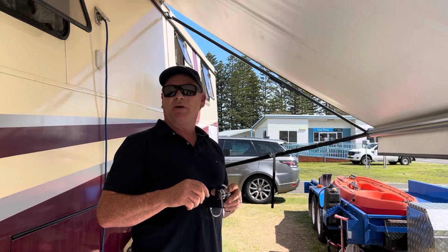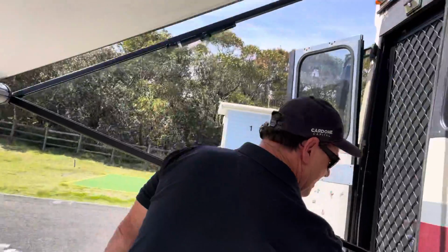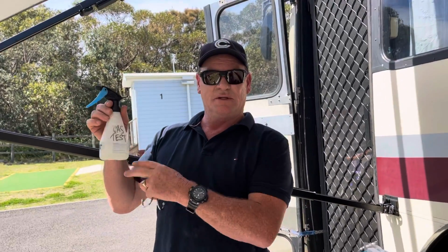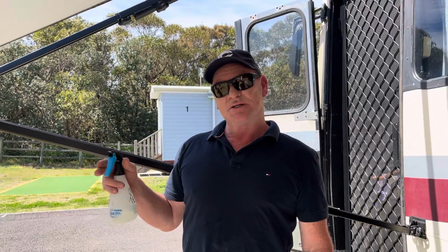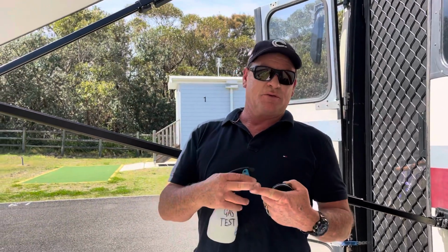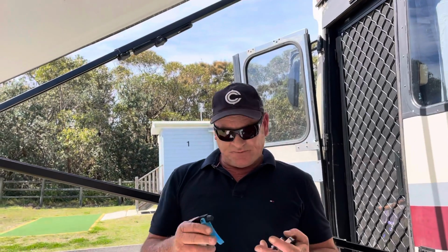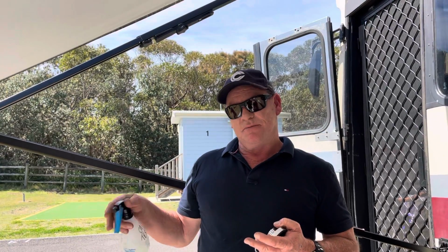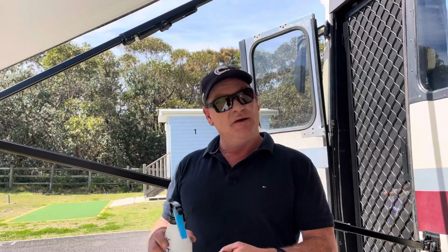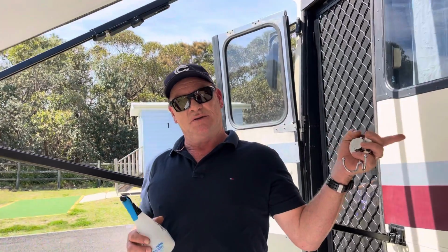And probably one more thing I would like to say. If you just follow me around here, we've got a detergent and water little test bottle that I spray on all of our gas connection points, whether it be for the barbecue, at the bottles themselves, on the regulator, on the hot water service. I'll do that probably once a week. And if you see any bubbles, you've got a leak. On top of that, we've fitted a 12 volt gas detector inside the bus.